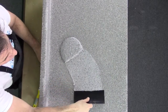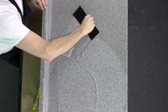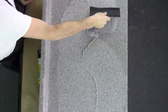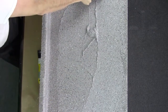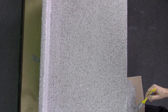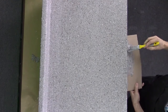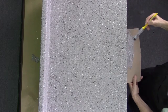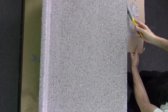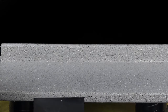For the second coat, apply the stone coat using the smoother instead of the brush to tightly pack the stone down and get this layer as flat and smooth as possible. All you need to do is press firmly with the smoother during application and fill in any texture or imperfections that might be visible. For the backsplash portion and the countertop edges, you can still use the small brush to apply uniformly. To make application to the front edges easier, use a small piece of cardboard to hold the material as you brush it on. When done, remember to flatten it with the smoother for best final results. Let it dry until the next day.